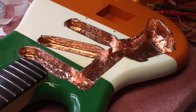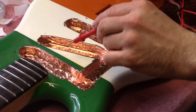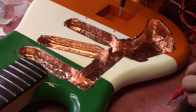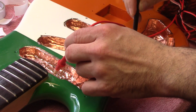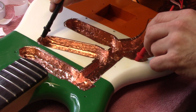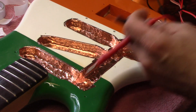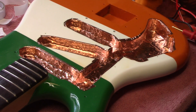We've shielded the inside cavity and we're just going to check for continuity to ensure there's a signal passing through all the copper tape. This means when we put the pickguard back on we get it completely closed — almost like a Faraday cage — to ensure we don't get any interference. You can hear it beeping, confirming there is continuity throughout, so we have a proper electrical signal going all the way through.